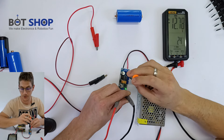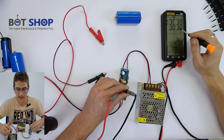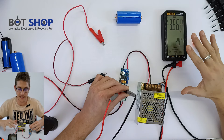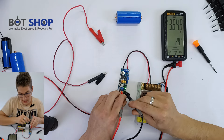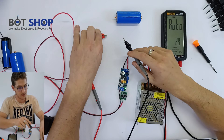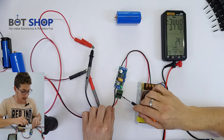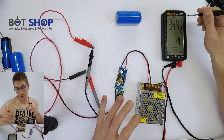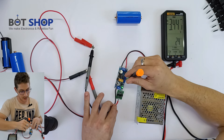What this board does is take the power in and convert it to a lower voltage. I haven't done anything to this board — it's standard, straight out of the shop. Let's see what voltage we're getting — we're getting 22 volts. So it is bucking, but not enough for our application. For this exercise, we're going to be charging this battery with a nominal voltage of 3.2 volts, but as seen in the graphs, you want to be charging it at 3.65 volts. I'm going to take a flat screwdriver and turn the left knob — turning it counter-clockwise decreases the voltage, and this is exactly what we're looking for.